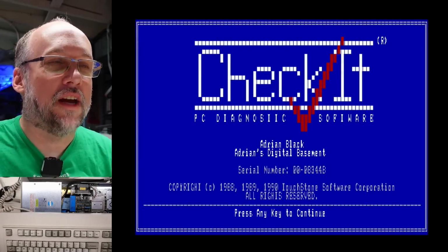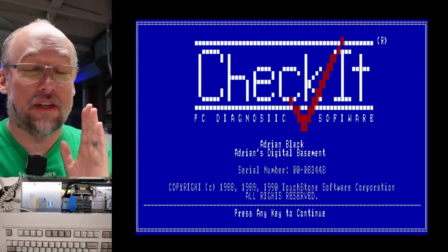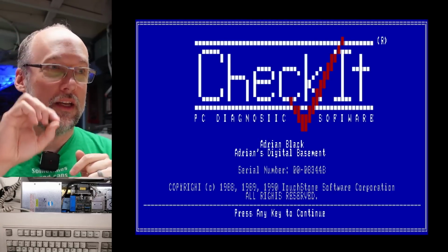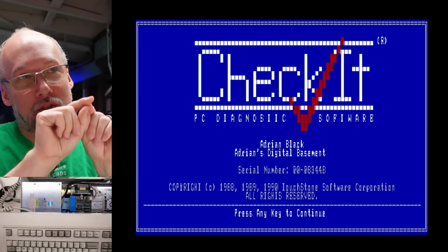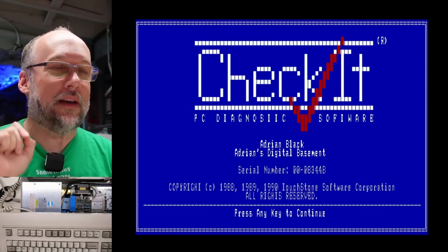Okay, so I just ran CheckIt because we're going to look at the character map, and right away we can see, as one of the issues appears, there seems to be a missing row entirely. So you see in the red tick mark there, it should be solid. There should not be any gaps between the characters, and the same goes for the CheckIt itself. That should just be all solid without any gaps.